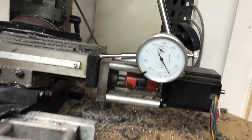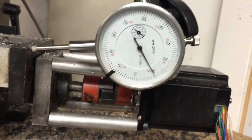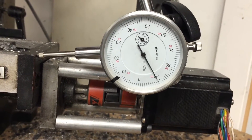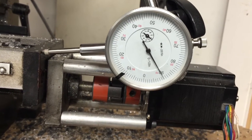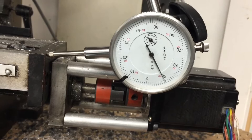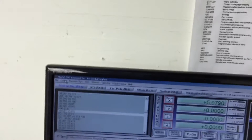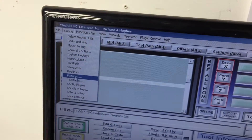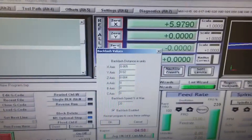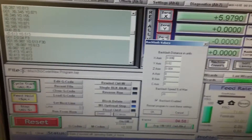Now to test the backlash I need to go the opposite direction. I'm steady at 90 thousandths and I'm going to start tapping the other way. You'll hear some compensation for the backlash. So that's fairly accurate — I need to add about a thousandth of an inch backlash for the X. Let me go to config, go down to backlash, go to the X axis and type in six thousandths of an inch.